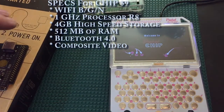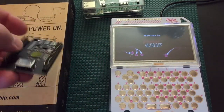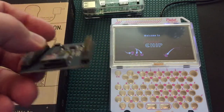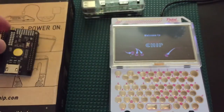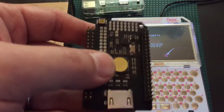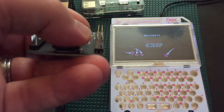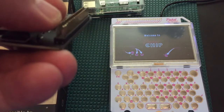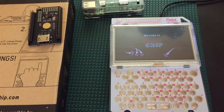The CHIP works with most screen displays. Composite is actually built in, but you can get DIPs for VGA, HDMI, etc., which just plug into the card. I have bent pins on these several times — it is a very tight connection, and you can see some of those pins on the right-hand side here are bent. Getting this out of the CHIP, removing it, can be sometimes a daunting task. I'm not sure if that's a design issue or just that I'm not patient enough with it.